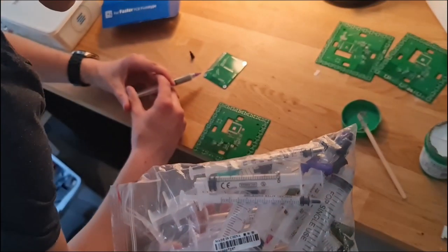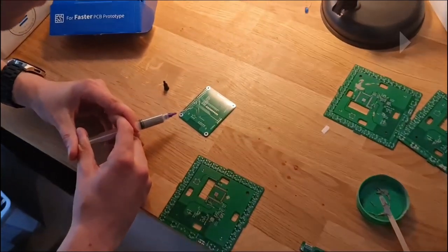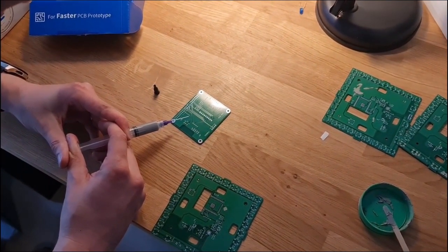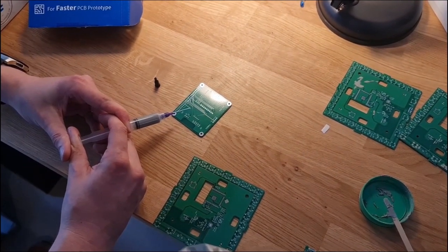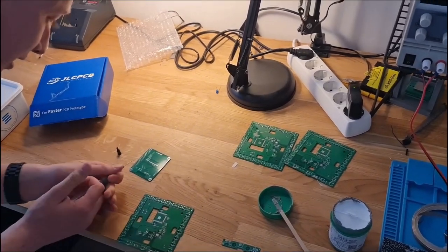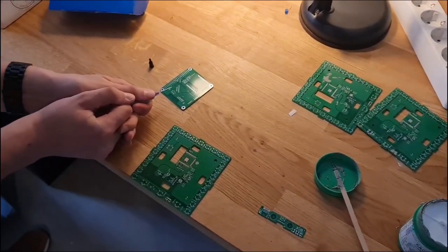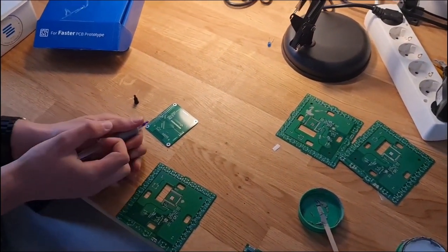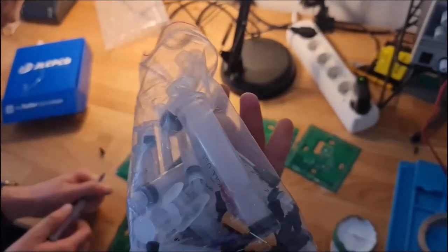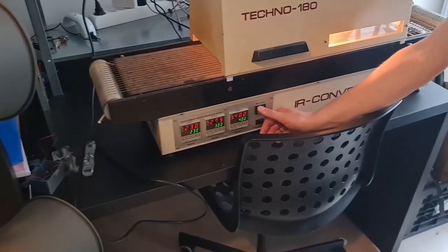There you can see we're going to slowly put the solder paste on the pads — just to test. We actually put it on the bottom PCB where you see the ESP32 footprint. All the syringes you can get from AliExpress — Bob bought them there, quite cheap, and it's just easier to put on the pads. There's a whole packet with all different sizes and nozzles.